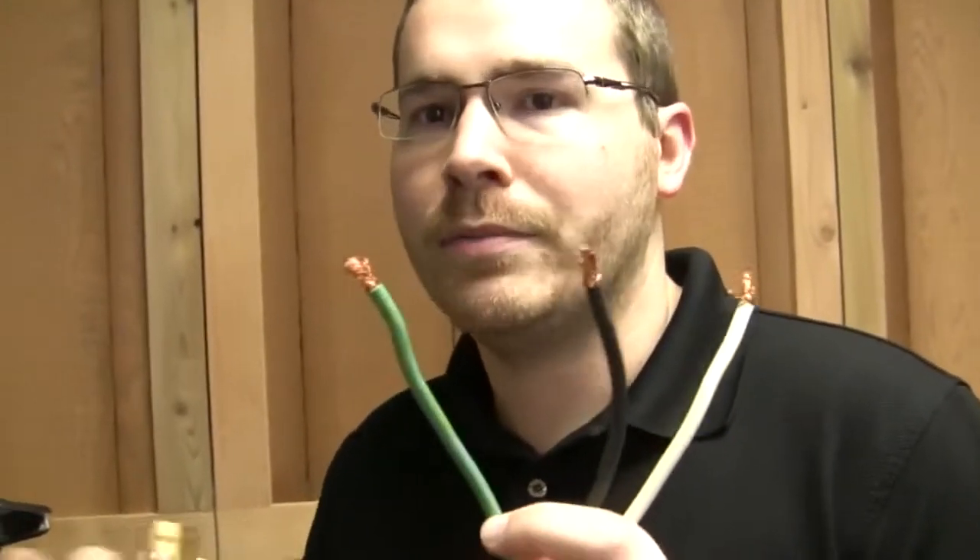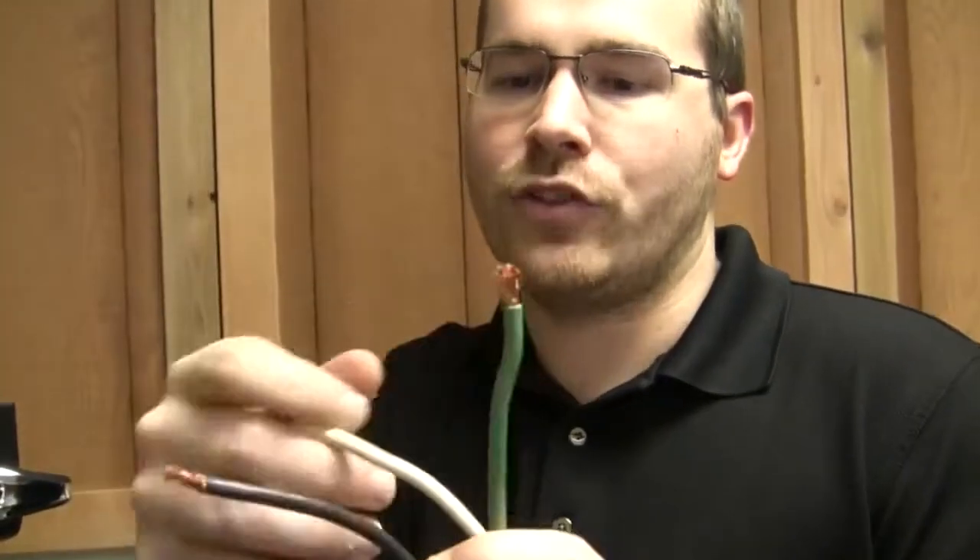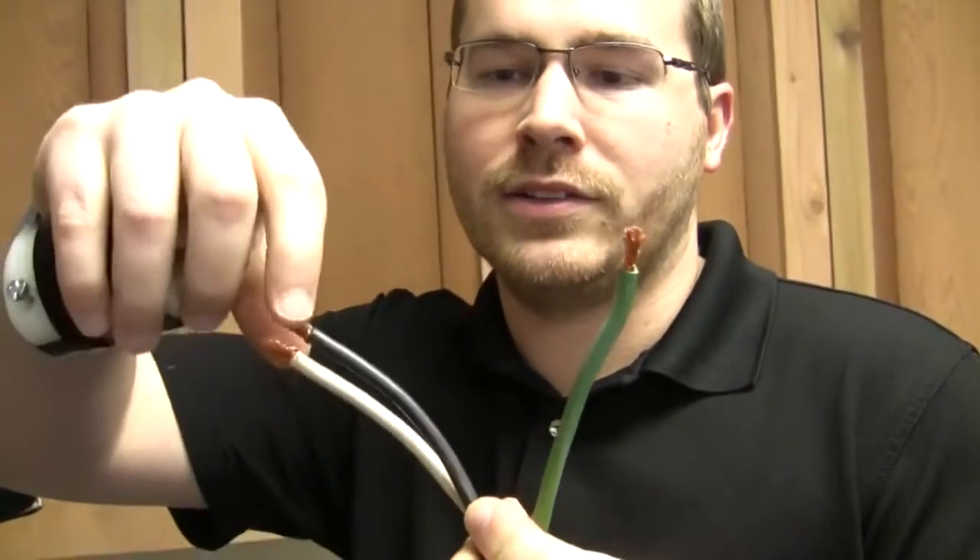The thing to know on this is it's three-wire 220 power. So we're in 220. In America we have two kinds of 220: four-wire and three-wire. All espresso machines operate off a three-wire, which means they have a ground and two hot wires. Basically, you combine these together and you end up at 220 volts.